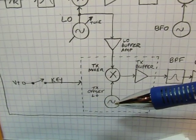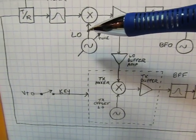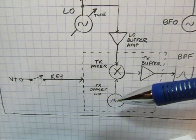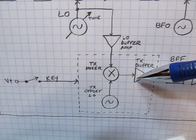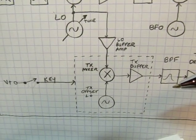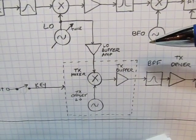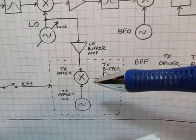There's no AGC throughout the IF chain — that's the whole receiver. The nice thing is it basically uses a whole set of 12 MHz crystals. Those crystals are used for the ladder filter in the receiver, also used for the BFO for product detection, and also used for the local oscillator for the transmitter. We take that same oscillator signal used as the LO on the receiver and feed it into the transmit mixer, mixing it with a 12 MHz local oscillator to create our 7 MHz transmit signal.